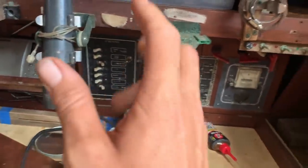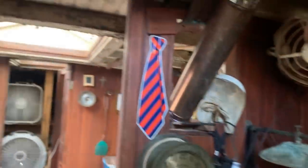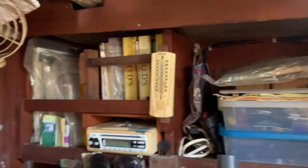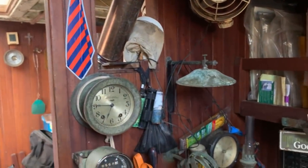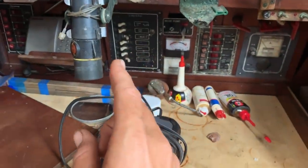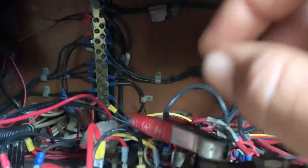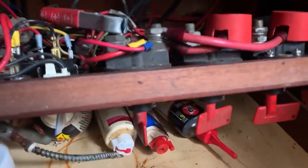What you want to look for in electrical: try everything if you can. With all the water damage here, I don't want to touch anything and shock myself. I'd disconnect shore power, disconnect the batteries, then check the condition and connections of everything. You're looking for corrosion — is it corroded to pieces? Are there tons of cobbled wires jammed on one thing? Look at the breakers. Here it's actually decent — not too bad.